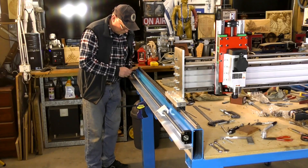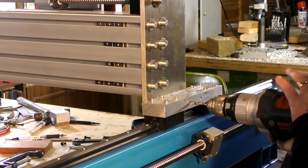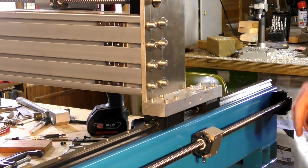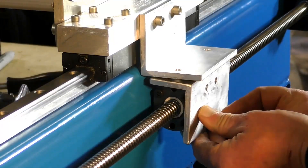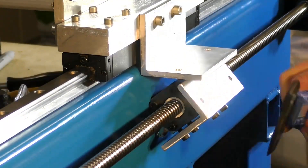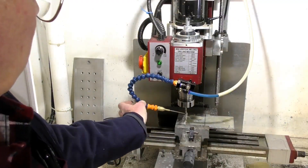I'm using that aluminium rail there — I put it and clamped it there and used it so I could get the screw up, pack it up, and get it absolutely square, running square with the Y-axis, which I'm just drilling the bracketry for now. Yes, everything was all nice and square. You've got to be within a few thou of squareness to be able for the router to actually run nice and smoothly. You don't want it binding up when it's running, because you could start having some problems.